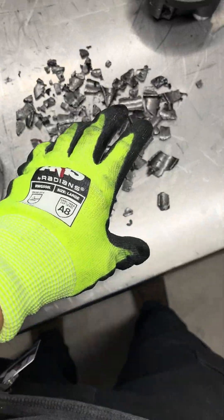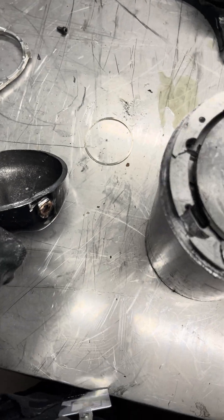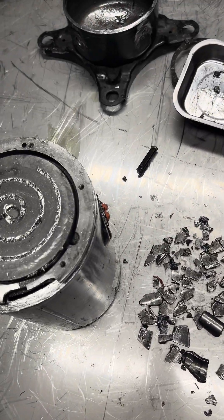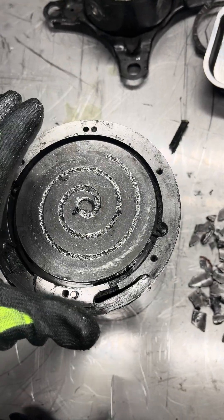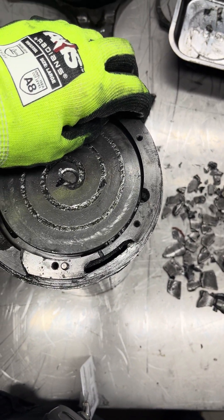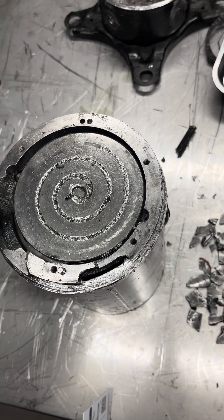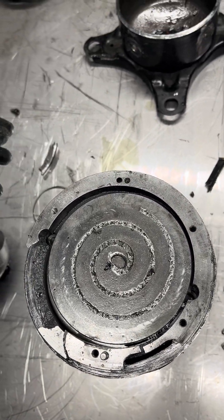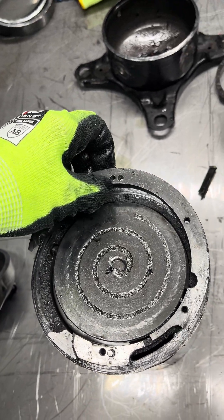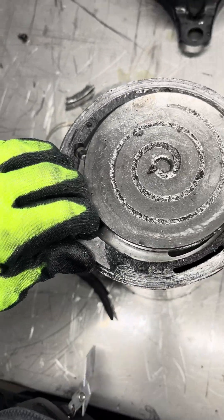With this jigsaw puzzle, I'm not going to try to put it back together. The compressor mount is a little alarming because I've been through this compressor with a fine-tooth comb several times, including my table, and I have yet to find this piece here. So we put it back together because we want to know how it broke apart and the failure points for stress, but also we want to ensure that any pieces that came out of this compressor are no longer left in the system. Large chunks of metal floating around that are going to cause restrictions after I change a compressor like this is a problem. And that little tiny piece is still holding on for dear life.